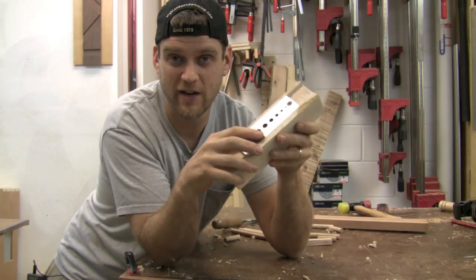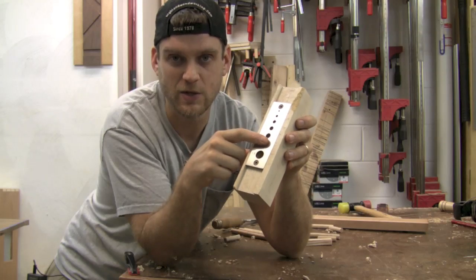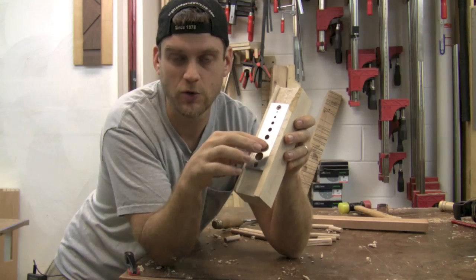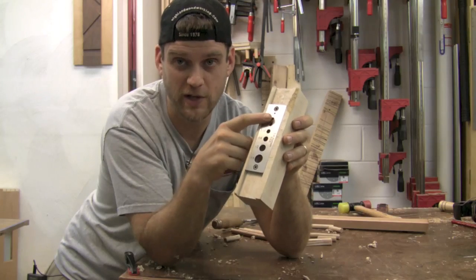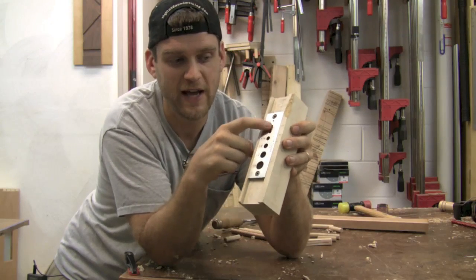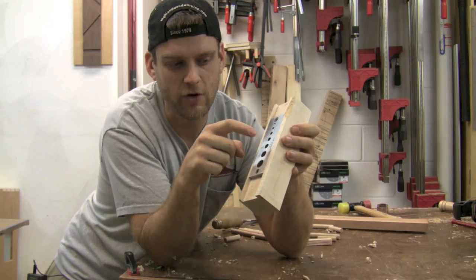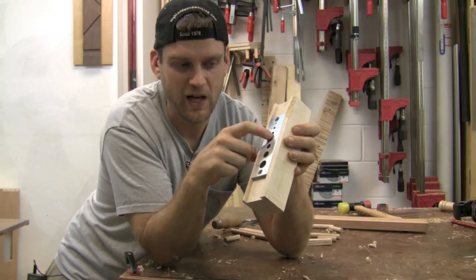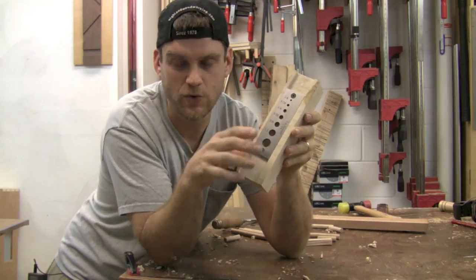So that's the one downside I found about this doweling plate, is that these holes are spaced pretty far apart, so I had to whittle or turn my dowel closer to that hole and then just bang it through one time, rather than going progressively smaller and smaller holes. Here down at the other end, you have space every 1/16th of an inch. You can definitely go from 5/16 to 1/4 and be left with a pretty nice dowel. But here at the top, that 1/8 of an inch was really too big.